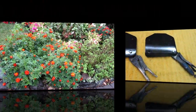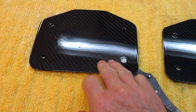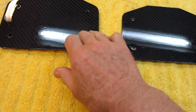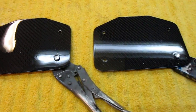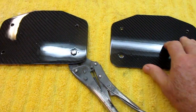I don't know. Now, a couple of days ago, these are the parts we actually made the sheets of. That's on one of the videos. And we put on the clear coats. Now, the clear coats are plenty dry. They're nice and solid now. You can always tell if you put your finger and press it in and it doesn't leave a real fingerprint. Probably it's pretty much ready to go here. Now, the first thing on this job, when you paint outside, you can see one right there, a little fisheye, a little imperfection.